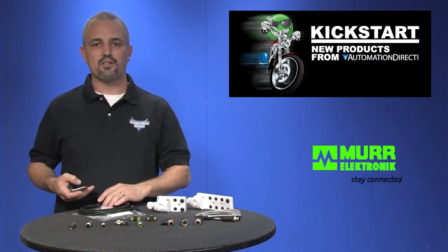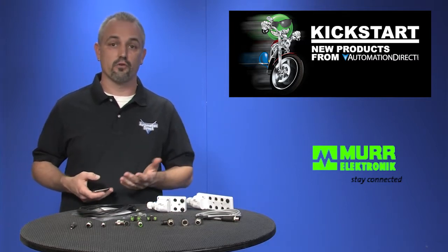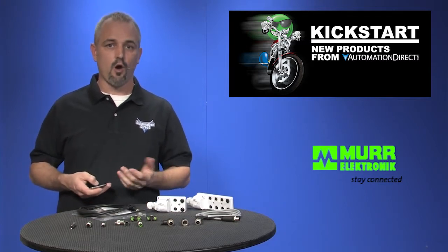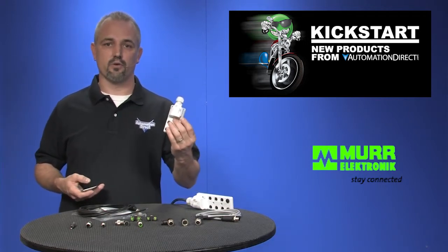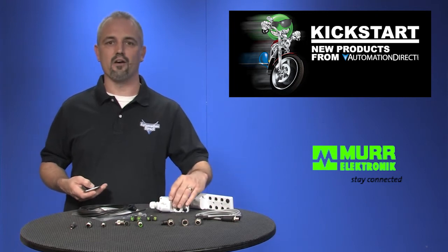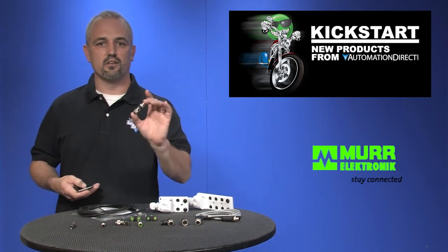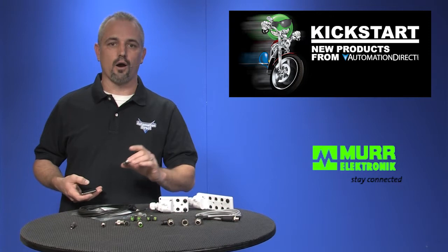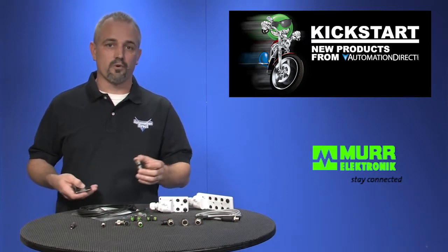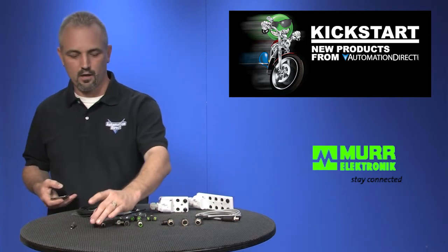They're used to make custom patch cable links from existing cables or bulk wire, or turn a pre-wired sensor into a quick disconnect sensor, or terminate field devices on an I/O block like this zip port that AutomationDirect offers. And you can do it in a matter of minutes. We're offering several styles like these insulation displacement connection, or IDC technology, meaning no tools are required — no need to grab a soldering iron or crimpers and connectors.